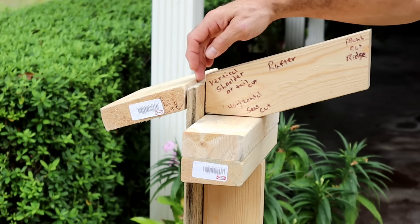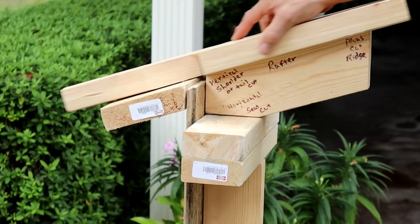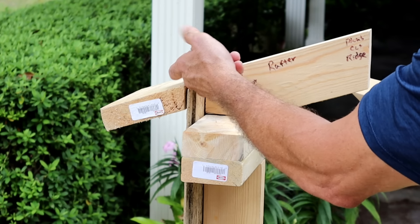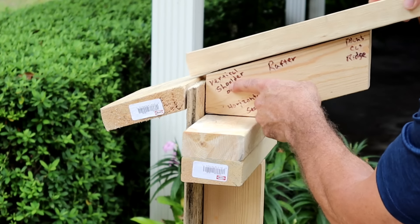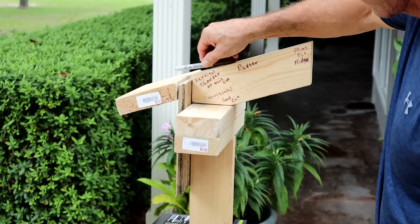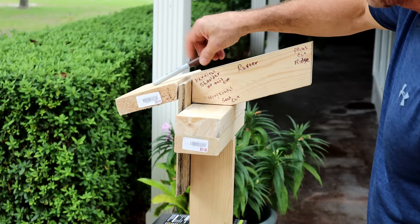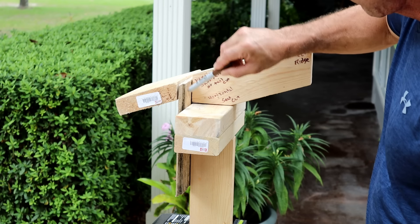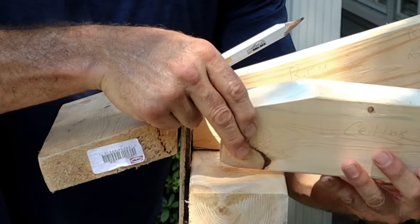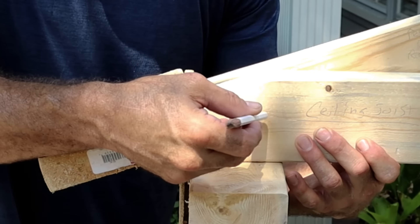This sheathing right here I always make it lower than your rafter so this can lay on top of there. If you put your sheathing on and it's even with that top, it's going to stick up and it's not going to sit flush when you put your roof on. That little overhang board is an inch and a half thick so you have that variance — you can play within that range. This board right here would tie in across the face if you wanted extra bracing, and this would be your ceiling joist.